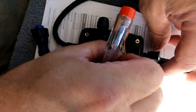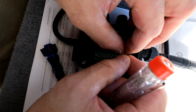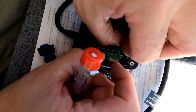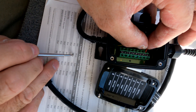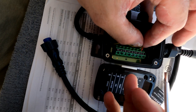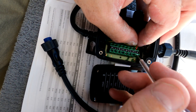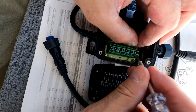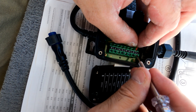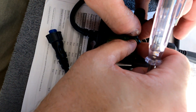Let's pull this all the way in here and give ourselves as much room as possible. There's not a lot of room because the cable hasn't got as much length as I thought. Let's very delicately push these into the terminal block one at a time. I'm following the pin-out here: red for one, black for two, bare for three, green for four, white which is the temperature return for five.